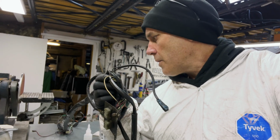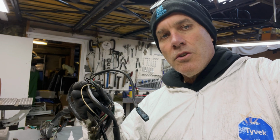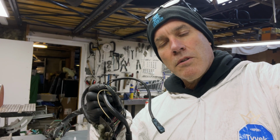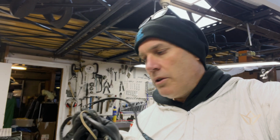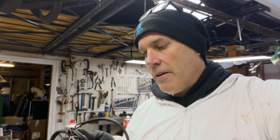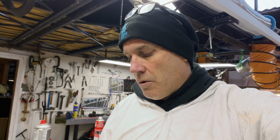I'm going to talk about the controversy that goes around reusing old looms. Now the argument would be that it's best to replace the looms with a new one because you never know, you get shorts and all sorts of problems with cables. In part, they're right. In other ways, it's one of those things that unless you check the loom and check the quality of the cabling and the wiring and whether they're frayed or crumbling, sometimes the plastic, when exposed to either fluids or to the weather, the plastic coating around the insulation or the insulation itself eventually gives way, and then you get shorting problems and you've got other issues.